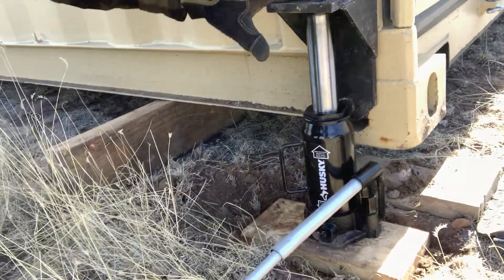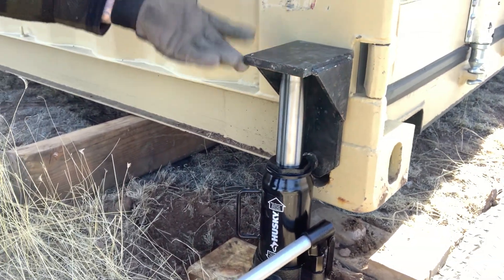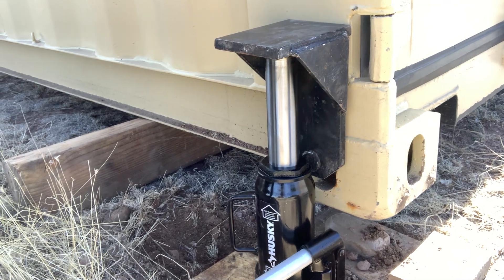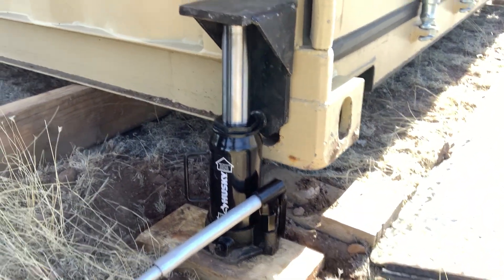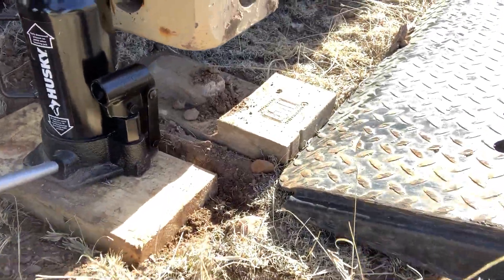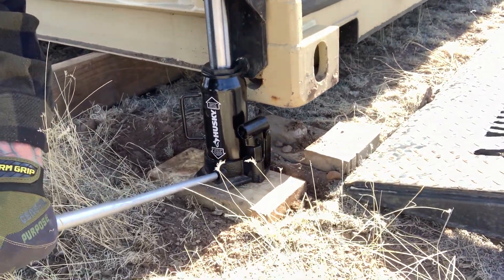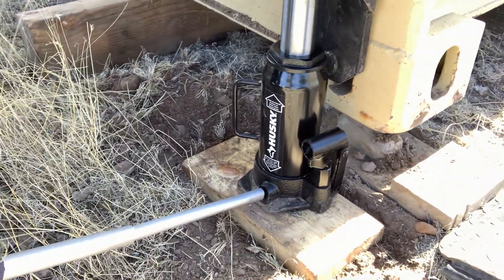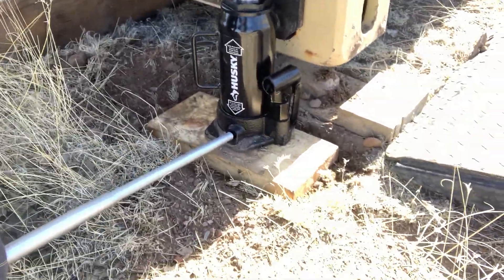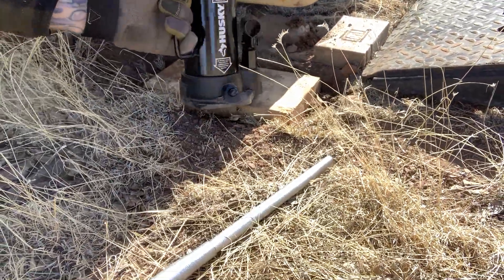Here's our jack and what they call a leveling block — I think it's from Superior Containers or Superior Shipping. I'll put a picture of it in the description. My 12-ton jack and wood are in place; my skids are down there. I'm going to realign those — it's precarious but it's worth saving your deck. I'll go ahead and turn this and we'll see it go down. Now we're sitting firmly on that four-by-six. I'm going to loosen it a little bit more and the jack will kind of do its own job.